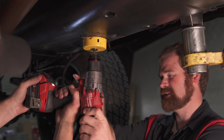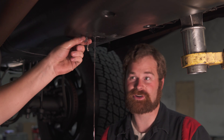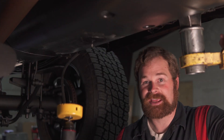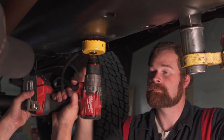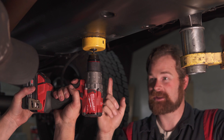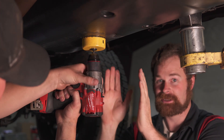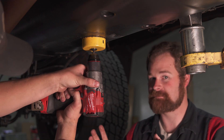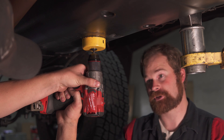As you can see, you're still going to have residual fuel even after draining the tank, so you do want to have a bucket or something underneath. Let this drain out for a minute. What you want to do is place the drill right up solid in the hole and go really nice and slow. You've got to get some speed on the bit, but you want to make sure you make a nice, perfect hole — you don't want to oblong it at all. This is the most terrifying part of this job, but it's really, really simple. So go hit it.